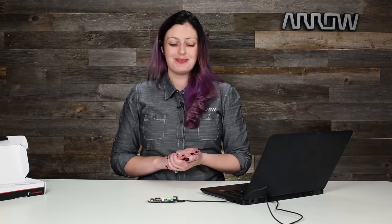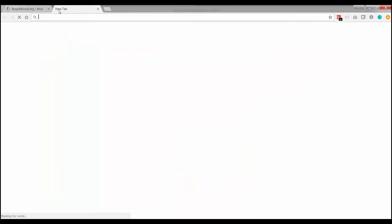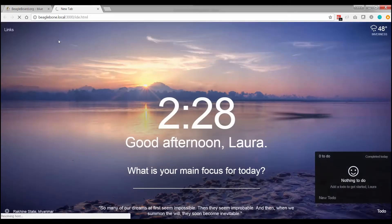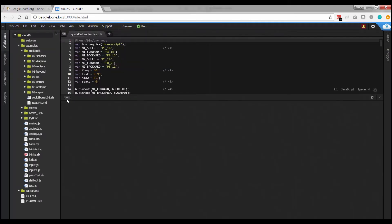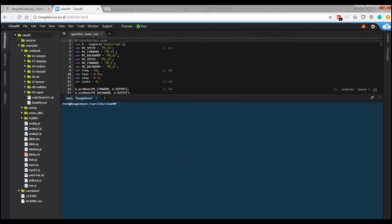The example code just will not let anything happen. So what we need to do is go to Cloud9, which is an IDE that lets you interface with this through the Bash shell and start programming on our own. Open a new tab and go to your local BeagleBone — if you need to get to Cloud9, there's a link on that getting started page. Open a new terminal window by clicking on the plus sign and selecting new terminal window. You will see that you are in the Cloud9 directory, and if you import any code from the getting started page for the BeagleBone Black, it's not going to run — the LEDs aren't quite mapped the same way.